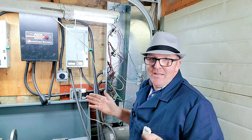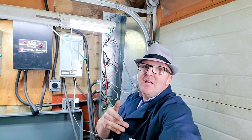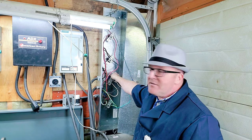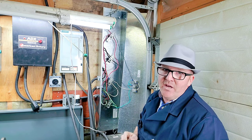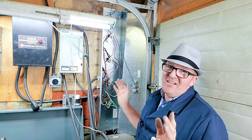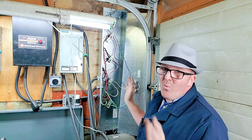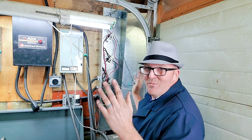The purpose of this splitter box is that I've got two transformers down here. This splitter box has little insulators inside — basically this big metal box is just a shroud holding a bunch of insulators that are tying off wires together. It's kind of like wire marettes on smaller wires in a 110 house, but a lot more big-scale and industrial. This box is probably way bigger than what I needed, but it was the only one I could get at the time because of supply chain issues.